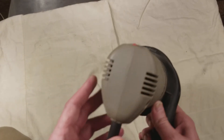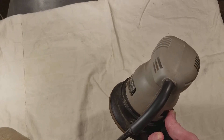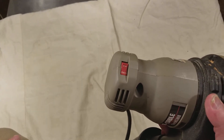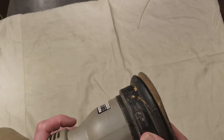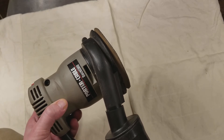If you can find a good deal on these Porter Cables, they're pretty reliable, but they're definitely a bit noisy — that would be my biggest complaint. Also, it doesn't have a shielded power switch, so that'll probably get clogged up after a while and you'll have to take it apart and clean it. You should always blow out your sanders often, because they clog up with a lot of dust.